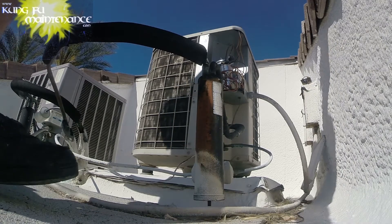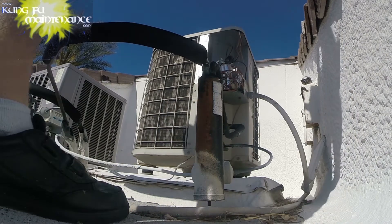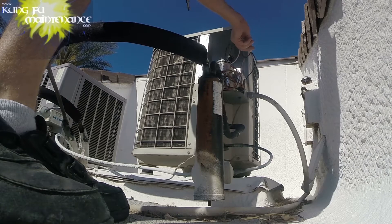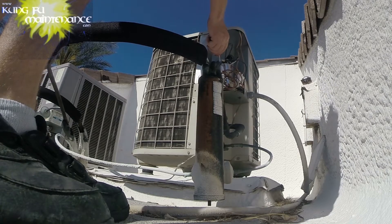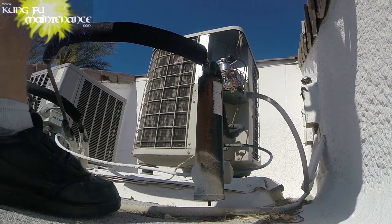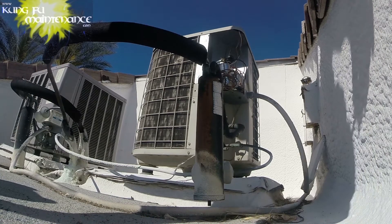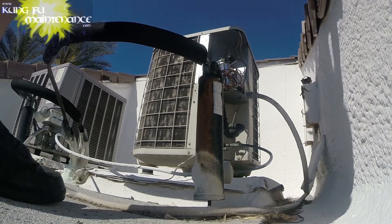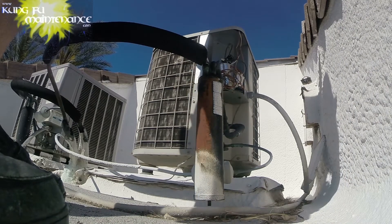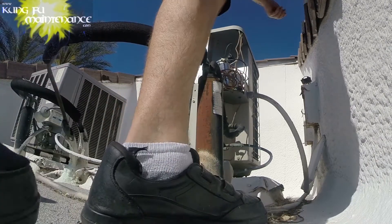This was the ICP and I think I put a 45 on here and it actually takes a 35. So I need to discharge the capacitor — the capacitor holds the charge in it even after the power is disconnected. Perhaps I could have taken a listen to it first; we can actually do that and I can re-discharge it after.